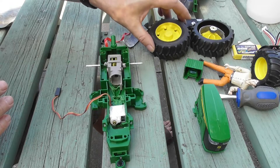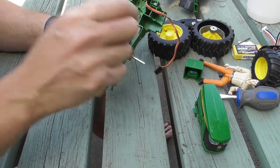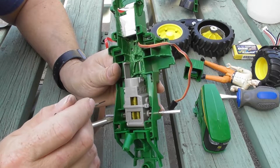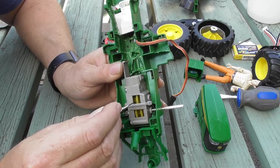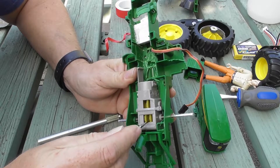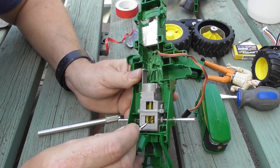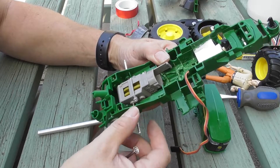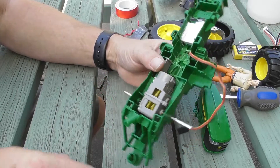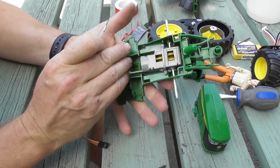I'm going to leave the wheels off until the very last because it's actually quite good to be able to get to everything. With these gearboxes it's really important that you've got smooth running. One of the things that can cause binding is if the bushing on this first axle isn't quite in the right place. I can see this gear is moving quite easily, so I'm happy that one's okay. We also have reasonable movement side to side on the other gears, and when I turn it by hand it doesn't seem to have too much resistance.